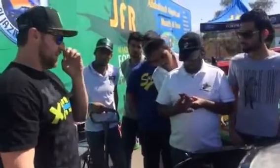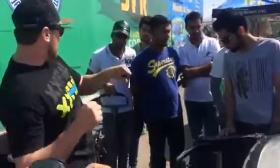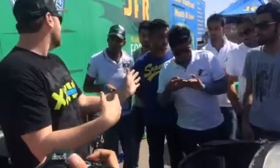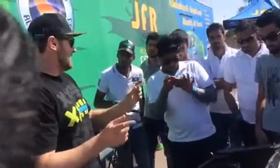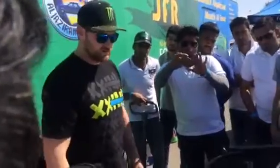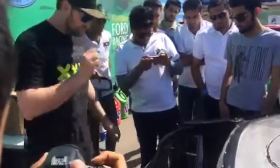Well, we space the wheels out in the front. That also puts wedge and more bite in the rear of the car. More flexible, but it also allows it to not touch the frame. And then we don't put too much. We make sure that the amount of angle we add, there's no interference. You don't want the wheels touching the body, or else you'll slow down and spin out.